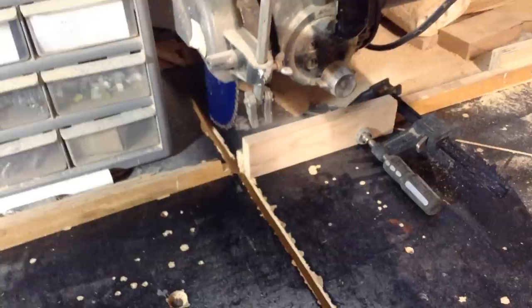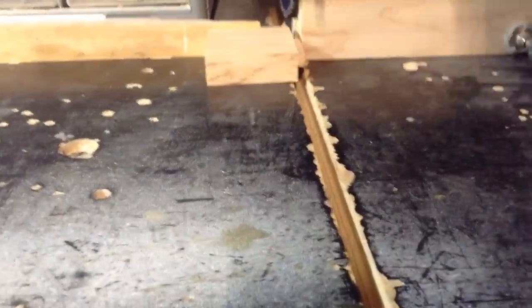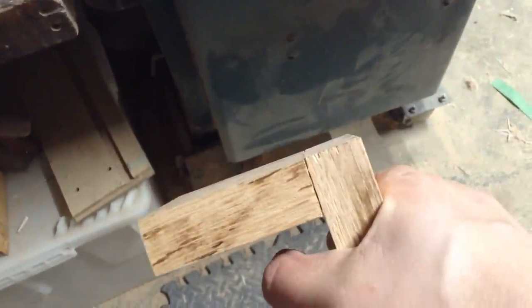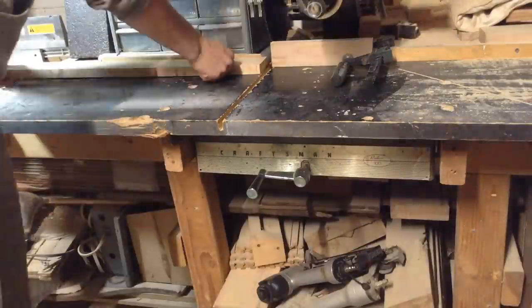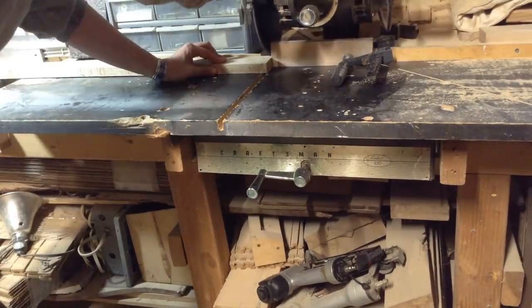Sometimes on jigs I don't spend the time to set this sort of stuff up, but because I'm making two of these at the same time, that means all of this is being done at least four times. And because I have two sides on everything, the process of making two at a time quickly means you're doing multiple things multiple times. To get the most accurate results, I'm setting up jigs. You can see what I was showing — the test tenon for the mortises. I always keep scrap cut from the same hardwood I'm using, and I made a test tenon to make sure everything was going to be flush and perfect before I go through and cut all of my tenons. I raised the blade of the radial arm saw, set a stop, and I could cut all of my tenons so they are identical.